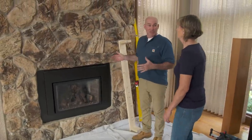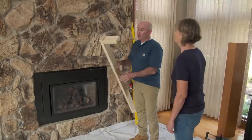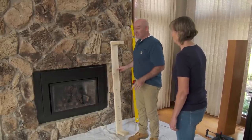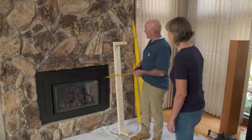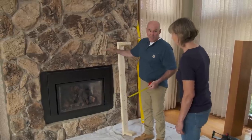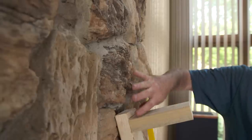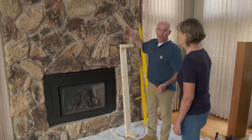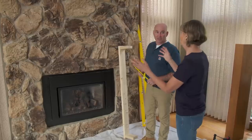Because we don't have any way of mounting the mantle onto the stonework, I've made up a cleat — just a couple of two-by-fours nailed together — and it's going to help me mount the mantle. The first thing I want to do is establish the height. Mantles are usually set around 54 inches, but unfortunately I have a bump right in that zone, so we're either going to have to go a little lower or a little higher. I think I'd like it a little higher just because it's such a big fireplace.